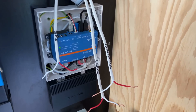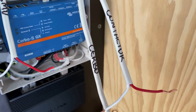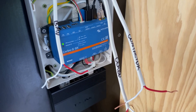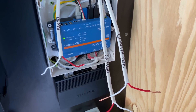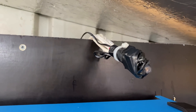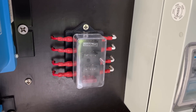The wiring is complete. I've got that cable going to the house up to the contactor, the cable that goes to the servo, and the cable that goes to the BMV. The BMV and servo cables are in parallel with one another — they switch that 12 volt relay. That 12 volt relay then switches the 240 volt contactor up in the house switchboard. I've got a 12 volt power supply energized by this 10 amp breaker, which runs up to here and is protected by a blade fuse down on the panel.